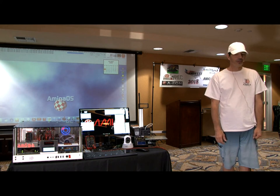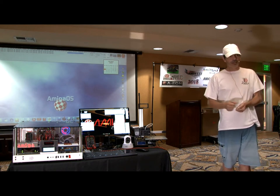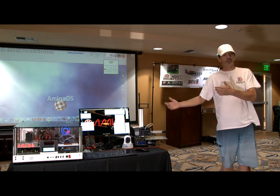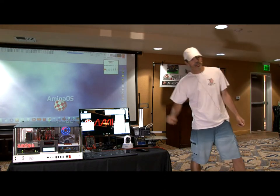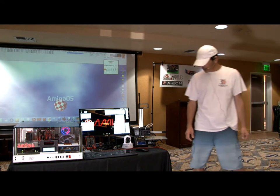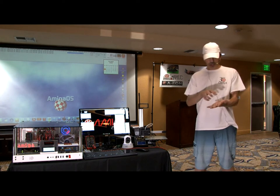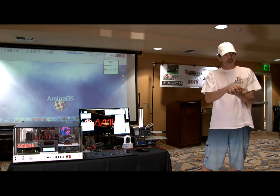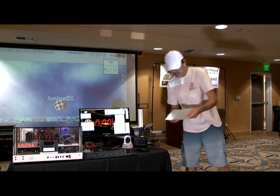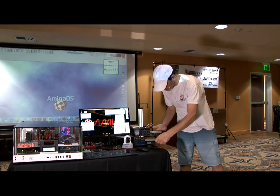You can start and stop the print — you can even stop it halfway, change the filament to a different color, and it will remember where it left off and just continue, because it's designed to handle power failures. To keep the piece from moving, the first layer really sticks. What you do is put a little bit of paper glue on the build plate and let it dry — with the heat, the plastic melts it and sticks really well. To remove it, you take the glass or flexi-glass plate and just bend it a little and the print cracks right off.